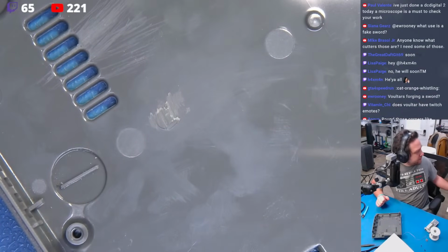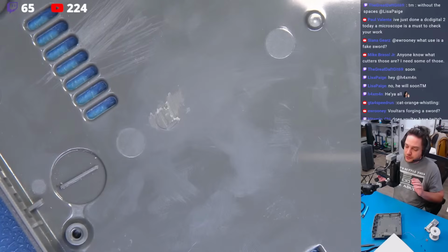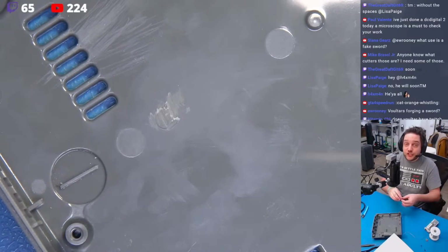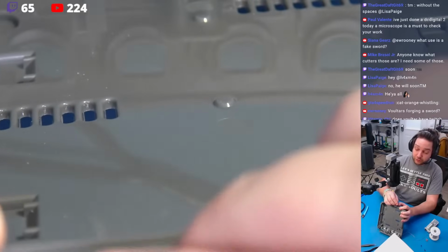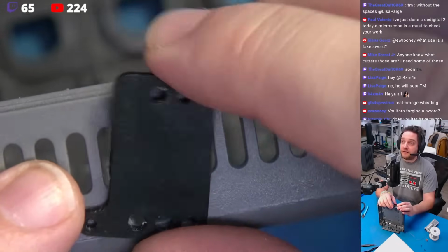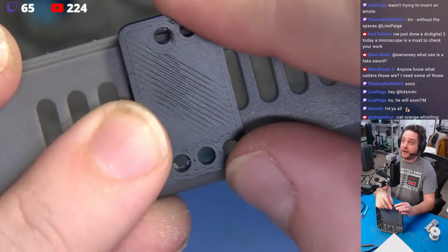The next step is to use a 3D printed jig to make the HDMI hole. I've already done this, and I'll tell you why. This jig is 3D printed. Unfortunately, with 3D printed parts, unless you keep your printers tuned and maintained at all times, there is a lot of variance in this part. You can see it shaking. We're talking by a couple of millimeters.